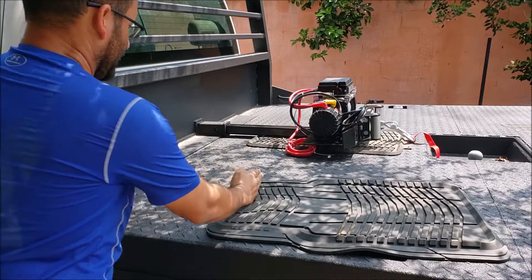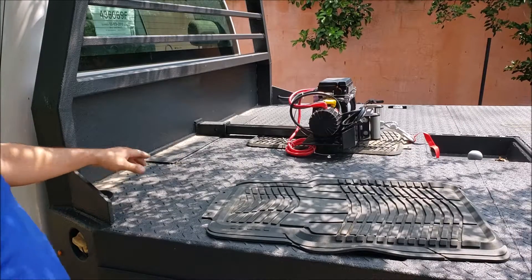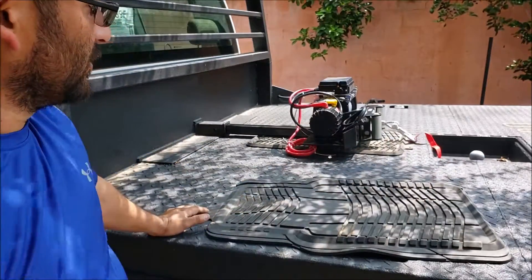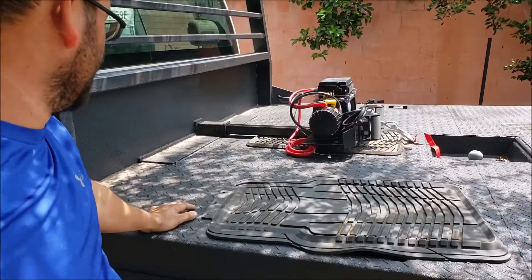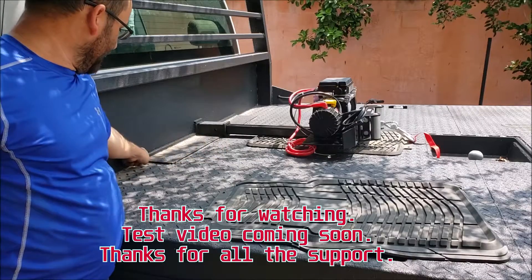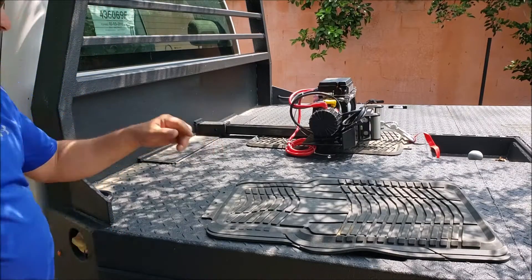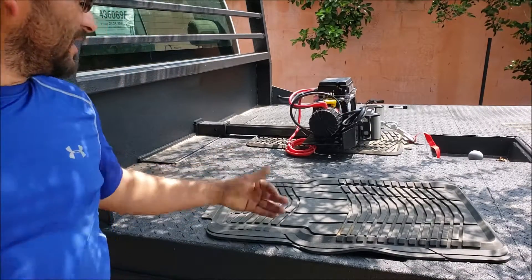So now I got to see where my welder's going to go and see if it clears it. Now I know that's a long shot right there on that 2x2 tubing, but the winch is going to be pulling straight, so I don't have to worry about it bending. If it's going to be going up at an angle, you might start warping the tube itself. This is half-inch, six by — I don't know — six by four feet, let's say, and it's welded all the way up on the channel this way, the channel on the backside, and the channel right underneath it right there. So it should be pretty sturdy.